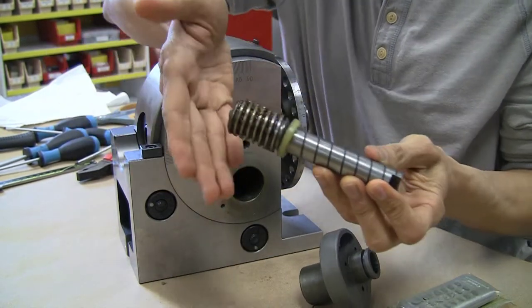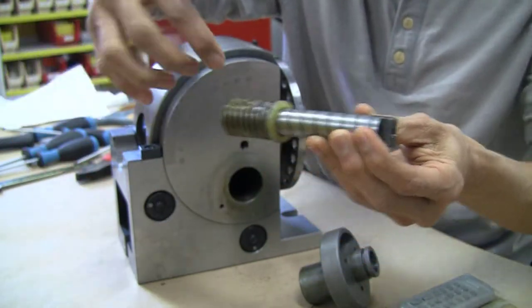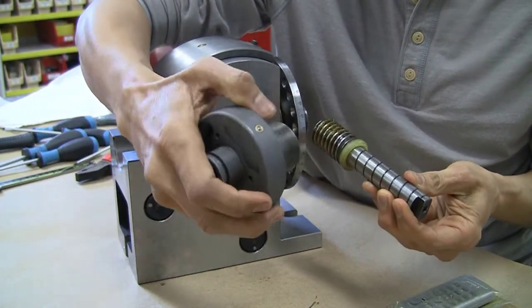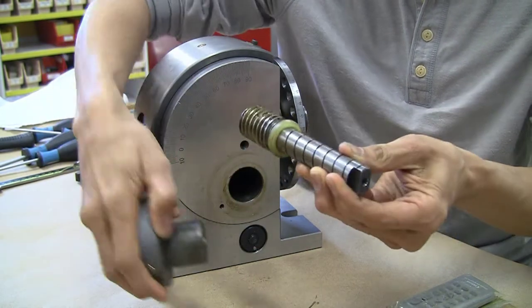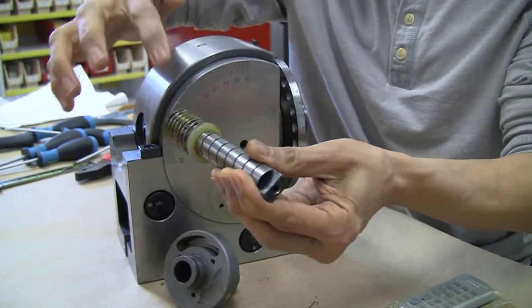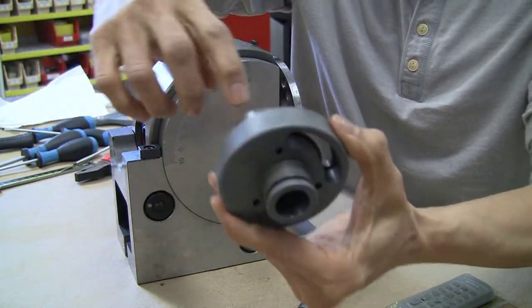The worm itself has a fair amount of grease on it, and the shaft has a spiral that runs along the length of it. The hub has an oiling port at the top that I am pressing right now, and that allows a drop of oil to go down onto the worm shaft. Presumably, as the worm shaft is turned, it moves the oil along the shaft and keeps it lubricated inside the hub itself.